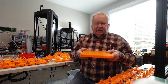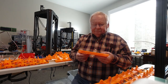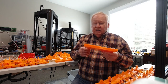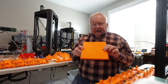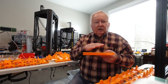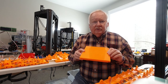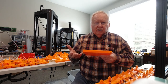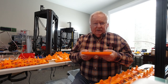On the glass bed, these just pop off once the bed cools down. But on those textured beds, even after they cool down, sometimes they're difficult to get off. So I've been experimenting using some glue on those textured beds — a water-glue mixture — not to increase adhesion, but actually to help retard the adhesion so that they don't become too fixed to it.